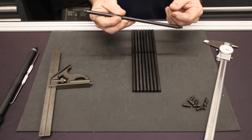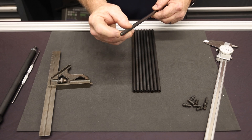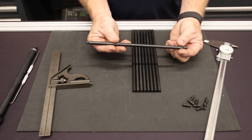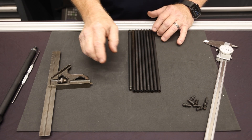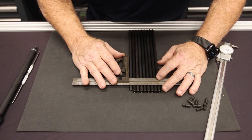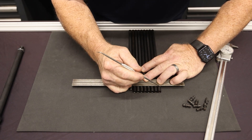Start with the length of the push rod that you've determined you need. You can measure this with a large caliper, or you could just scribe a line that is 10 millimeters, or about 400 thousandths shorter than the push rod that you've set. For this video, I'm going to set this on a straight edge next to my push rods, take a square, line it up with the base of the tip — which is the same as the tip I'm using — and just scribe a line across these.